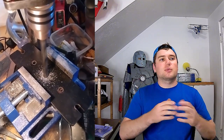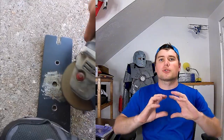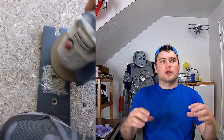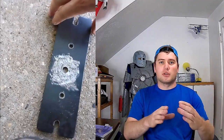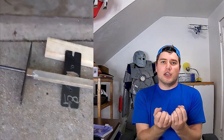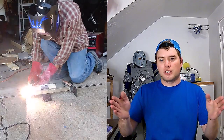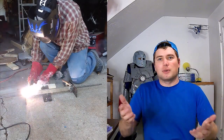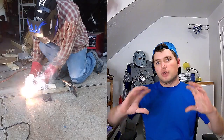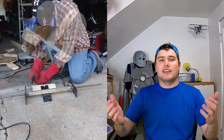We didn't have time to swap it to a 1-inch or 3/4-inch, which would have probably been a better option. What I'm doing here is building metal reinforcing brackets for the sides of the paddle wheel, because I don't want all the force going through that half-inch rod. I've got this metal 1x1 that I had sitting around, slid that over the half-inch shaft, and welded two end plates to it — quarter-inch thick mild steel pulled out of my scrap bin. That's going to redirect all the torque that would normally go into the shaft directly into the 1x1 piece of metal instead, making it a lot stronger.